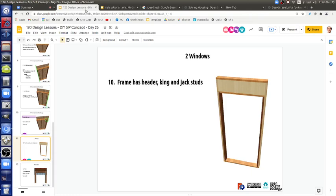So what are the other things you need to know? What size is this frame, first of all? 4x8. It's 4x8. No, 4x9. Well, almost 4x9. But whatever it is, we know we're using the pre-cut studs, which are those in the middle. If you didn't know that information, you could still build it. You could say it's 4x8, but you're actually building 4x9, and it will still be okay, because the material is a pre-cut stud with a top plate and a bottom plate. So the king stud spans between the bottom and top plate, so you've got the standard frame as everywhere else. Next, that's a 2x12.